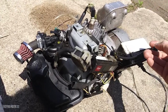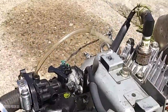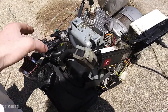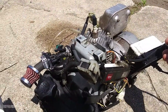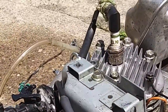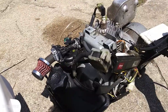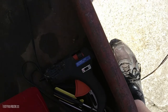I'll do it again so you can see the governor respond to me trying to stall it. We'll let the breaker pop here - this is really a lot of load for this poor little engine. I'll try to let it stall by holding off the spark - it went off and re-started, it'll recover itself. I'll try shutting the throttle all the way - see, see? That basically shows how it works. It's not a bad engine at all - a lot of love and a lot of life.